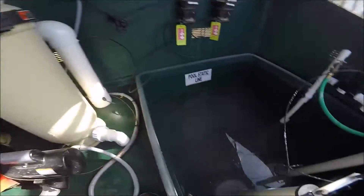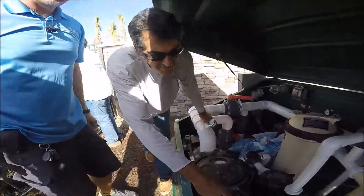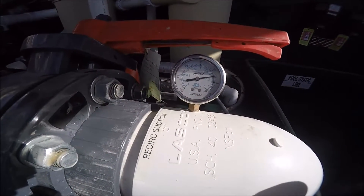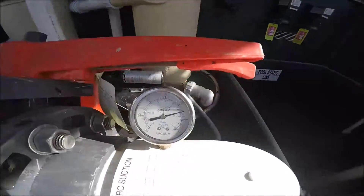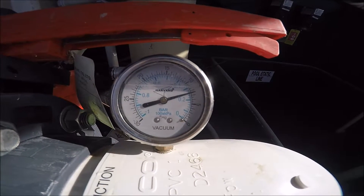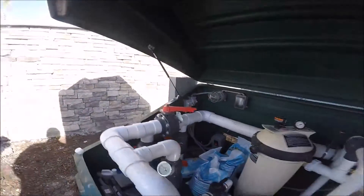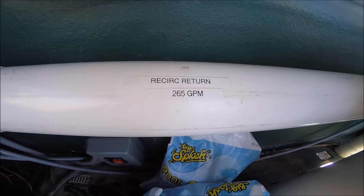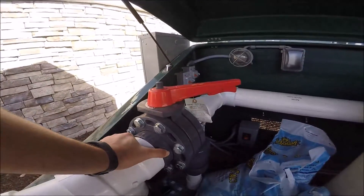Now you're in filter mode. If you've got plenty of flow, pull your head. That's our cooling filter reading right around 7 — this can make it up to 12 or 15. If this gets up to 12 or higher, it needs to be cleaned. If your flow is less than 265 gallons per minute, the filters need to be cleaned, or you need to adjust the flow from this valve.